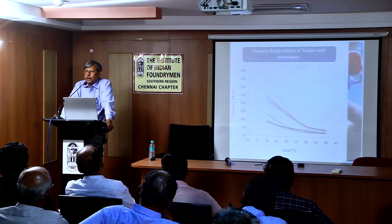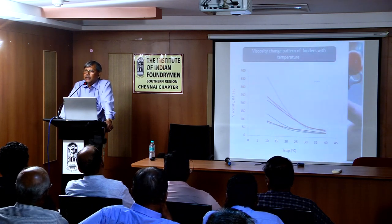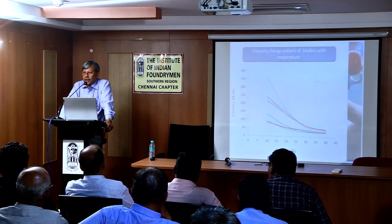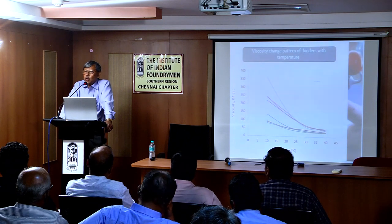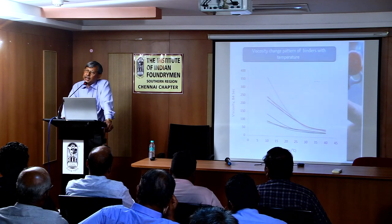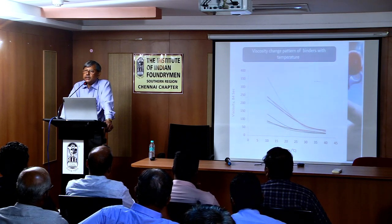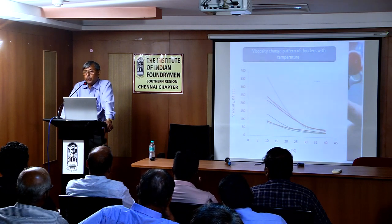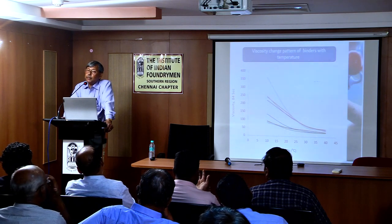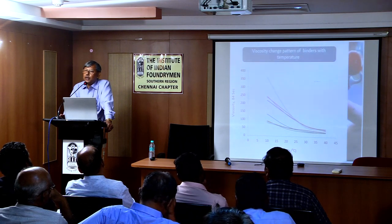All the parameters, your base resin, its constitution, solvent, solvent composition, need to be chosen to see that throughout the year, if it is in your country, you can control it. I can control in Delhi that in winter I change the composition and make it usable. But when you are exporting it, you cannot do it. We have got a lot of customers in South Africa. We cannot do it, so we have to find a solution so that throughout the temperature range, the viscosity does not go beyond a particular point.